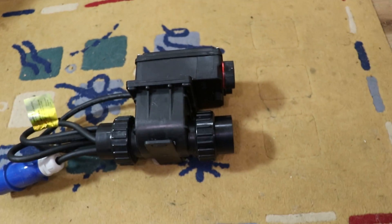So let's get this 1kW one put on and see how we get on. So there we go, that's the heater on - that's how I'm going to put it. The water obviously flows up through it like that because you can only put them one way around. There's a little flow switch in it at the outlet side, so the pump will push against the flow switch and activate it. And then the water goes into the filter. Not quite how I wanted to install it but I think it's the best way of doing it.